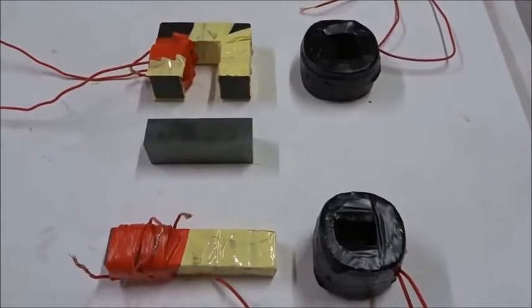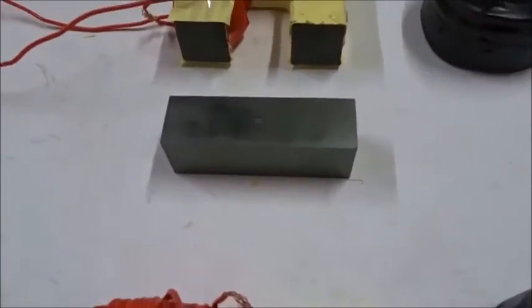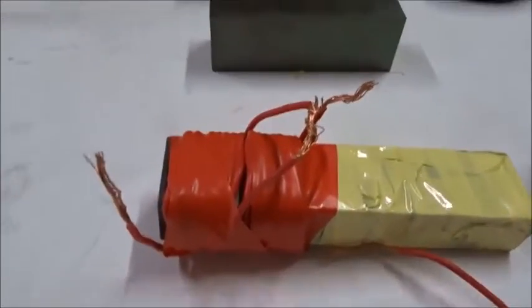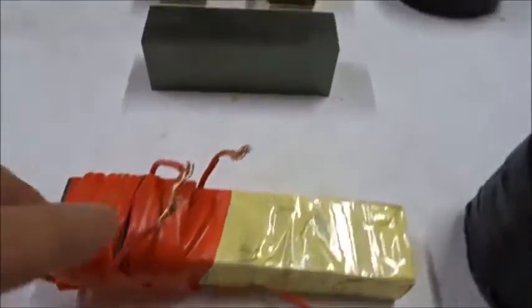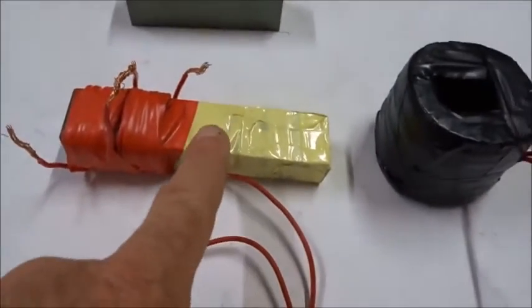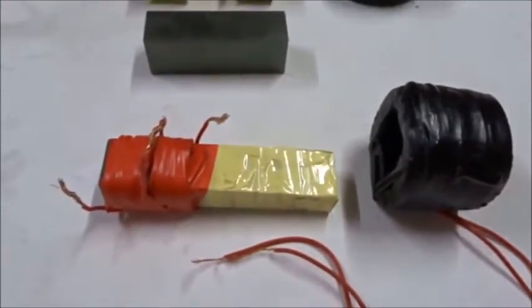Today we are going to study two kinds of high voltage transformers with ferrite iron at their cores. The first is a ferrite bar, around which I've wrapped eight plus eight turns of a primary coil with attachments on the two ends and in the center for zero volt switching. We've covered it with mylar tape as insulation, and we're going to put a coil with two thousand turns over the end to make power.